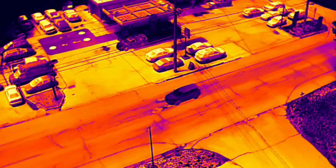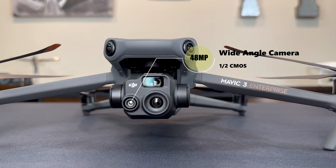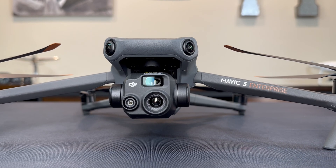If you're looking for a drone with thermal imaging, the new Mavic 3 Thermal, the Matrice 30T, and the M300 all feature a 640x512 radiometric thermal imaging sensor with outstanding performance. When deciding which model works for you, you really have to weigh your budget versus the features you desire. If thermal imaging is your main priority and you don't need all the bells and whistles, then the M3T is going to be your best and most affordable option. Alongside its thermal sensor is a 48-megapixel one-half-inch CMOS wide-angle camera, as well as a 56x hybrid zoom camera. It has the same 42–45 minute flight time as the M3E and is the smallest and most portable of the thermal imaging options. If you have a larger budget, the M30T and M300 should be considered for their advanced features, weatherproofing, and higher wind resistance.